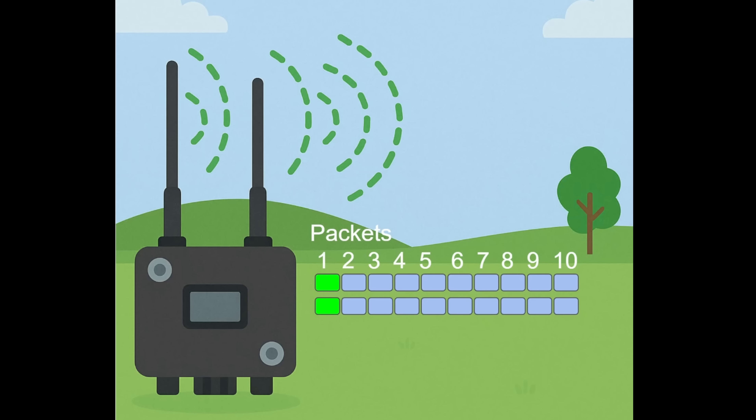As shown in this animation, we have a dual antenna transmitter — each of the bars across the bottom is one antenna — and you can see we are transmitting each packet from each antenna at the same time. There is also the option of combining the data from the two packets. The basics to understand with spatial diversity: both antennas are used to send the same packet of data roughly at the same time.